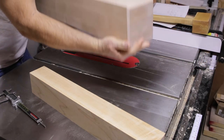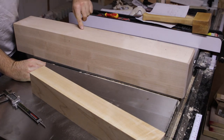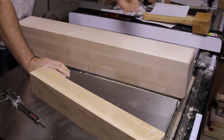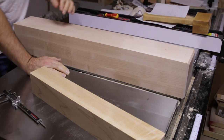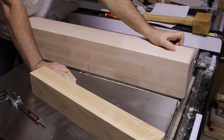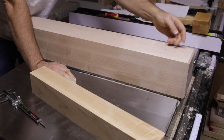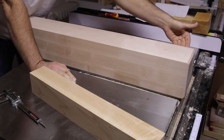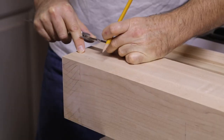This is going to be the most complicated leg. This is where the crisscross is going to go for the leg vise, and then the other mortise will go on the side over here, which is going to interfere with this area a little bit. I decided to go ahead and make it like the Chris Schwartz book says - two and a half inches deep on the front stretcher - which will go into this area but at a depth. This will be one and seven-sixteenths deep, so when I cut this out it's going to take some of that tenon off for the front stretcher. I'm marking one of the leg tenons here, using the calipers to scratch a mark at the exact distance needed.